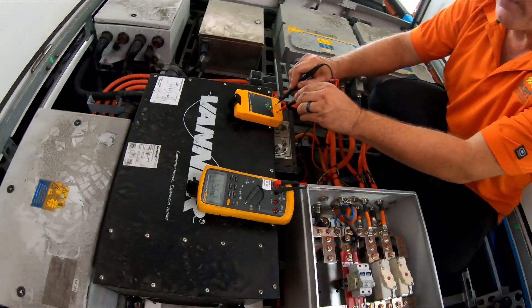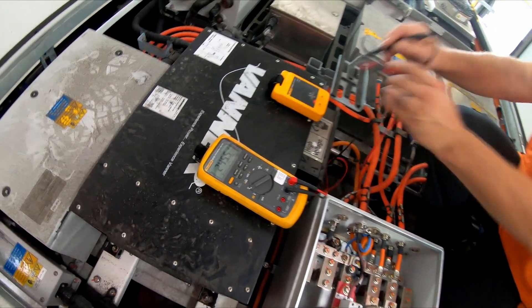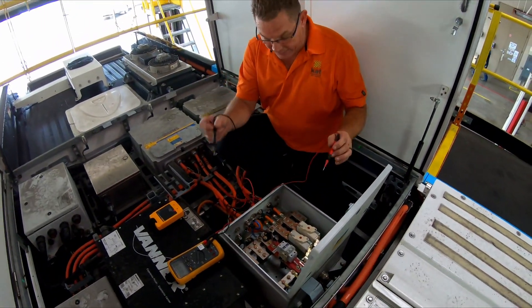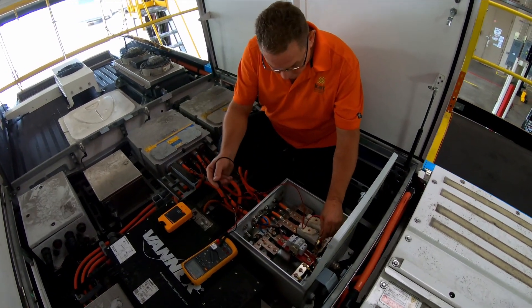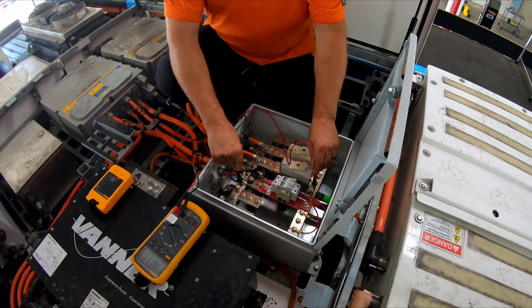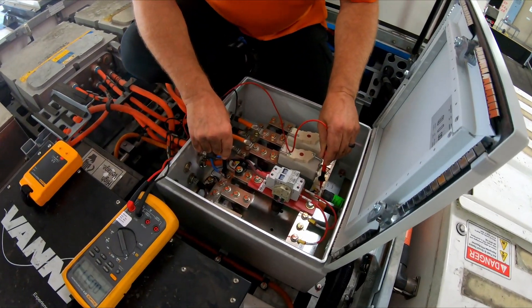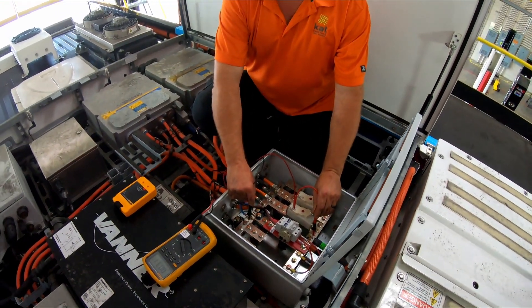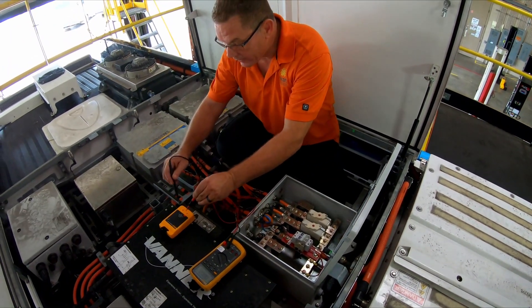I check that and read my meter — it says 245, that's within spec. So the first thing I want to do is go ahead and do a positive-positive, negative-negative reading. I go here to my positive bus bar, then my negative bus bar — I see that reads 0.031 volts. That's pretty much zero on the DC. After taking that reading I want to make sure I go back and prove that my meter is still functioning and I do get a reading.